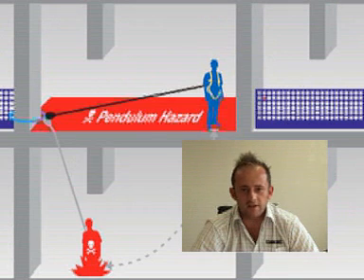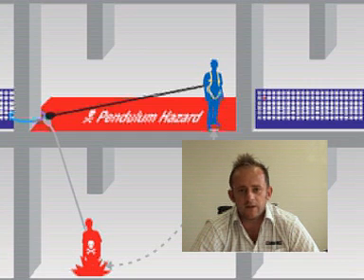On this diagram, you'll see that the guy's gone to work with his inertia wheel — he's gone to the front column and attached his inertia wheel at the front. Working like this means you cannot come past mid-span because of the pendulum effect if he falls.